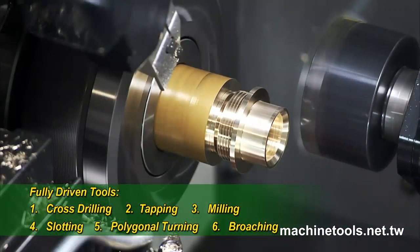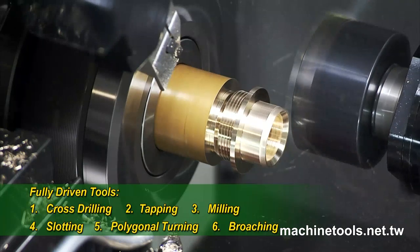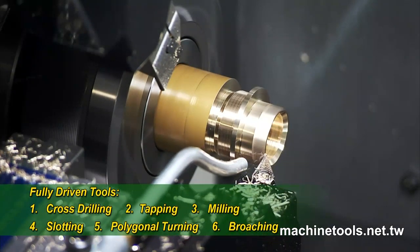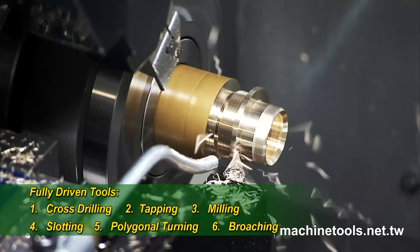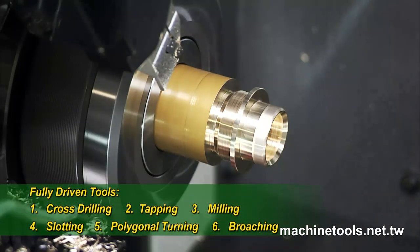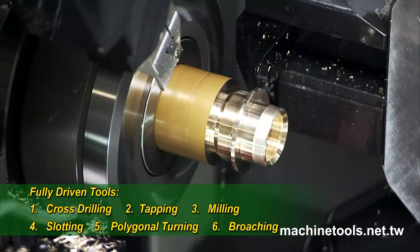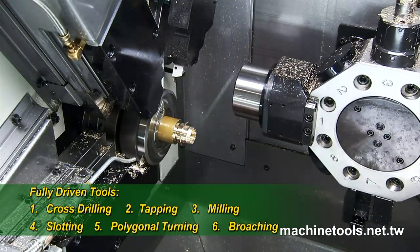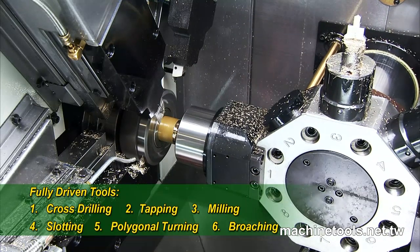The three independent compound cross slides on this machine are all servo and ball screw driven for super accurate cutting and work together to drastically reduce machining time. If no back machining is needed, the front part catcher collects the finished workpieces at this stage.